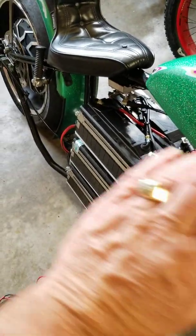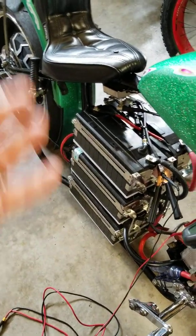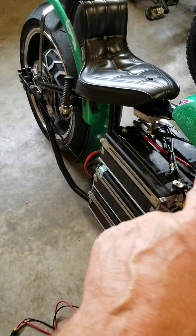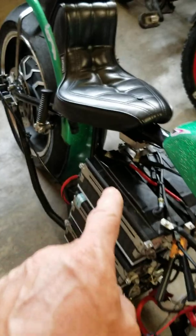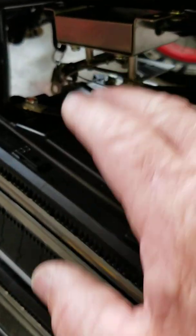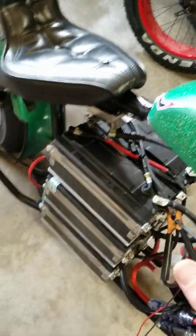Instead of running these flat square blocks as-is, I loosened everything up so I could access the top of the cables, then retightened and rewired everything across the backs of the cells. There's a bus bar that runs from one side over to the other, covered with protective caps — it simply connects the two packs of 32 volts in series, giving 64 volts.